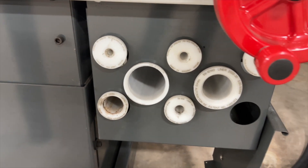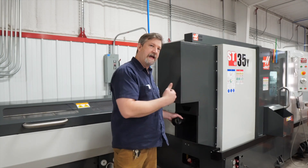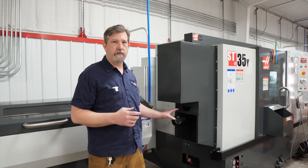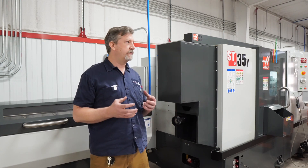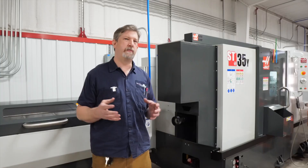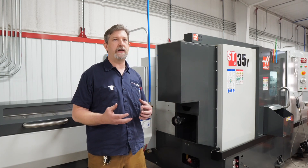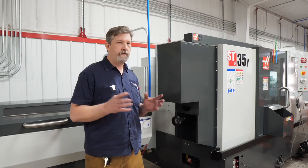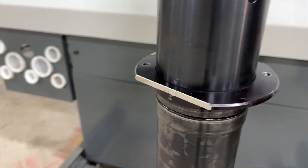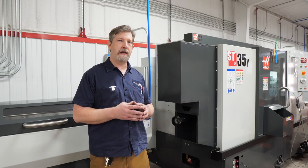One thing I never mentioned before: you can get the thread pitch on both the inside and the outside from Haas's webpage. I made three or four of those adapters and it would never screw into the inner side. I believe it was listed as a four-millimeter pitch, but it turned out it wasn't a four-millimeter — it ended up being like a 4.2-millimeter pitch, and that was the only way I could get it to screw in. I really had to play around with that. I spent a day coming up with a solution, which it is what it is, but that's something I think the factory could really improve on and take care of for future use.